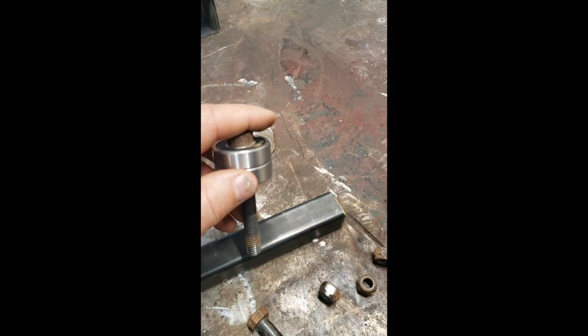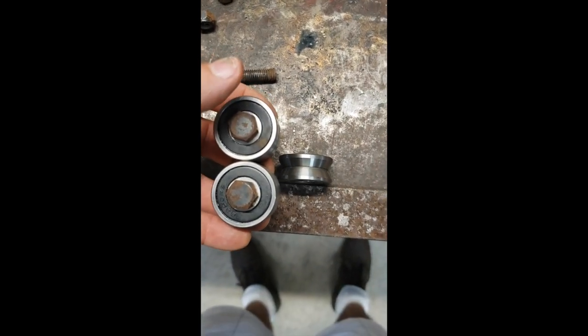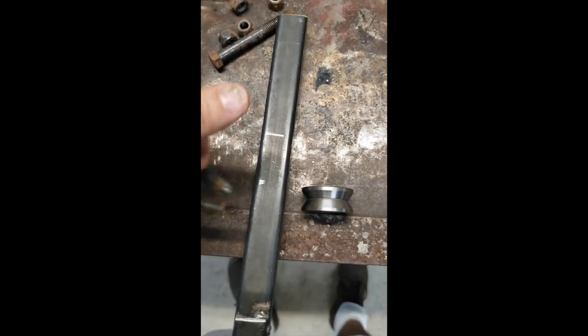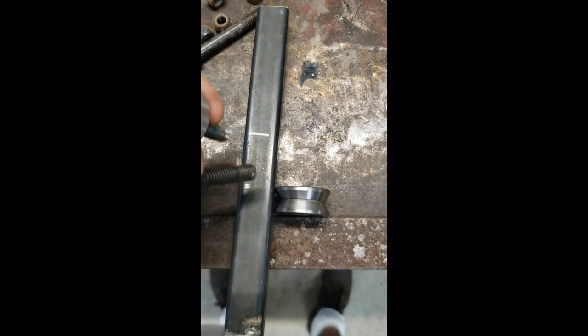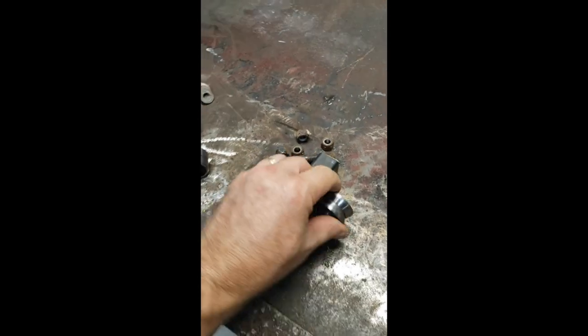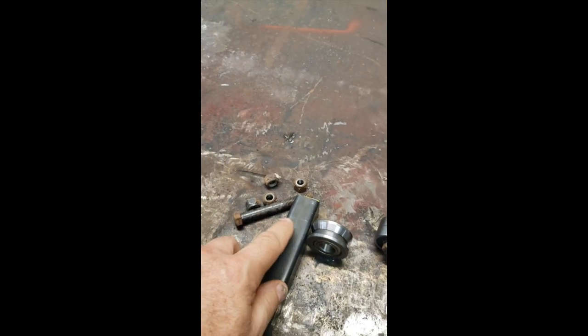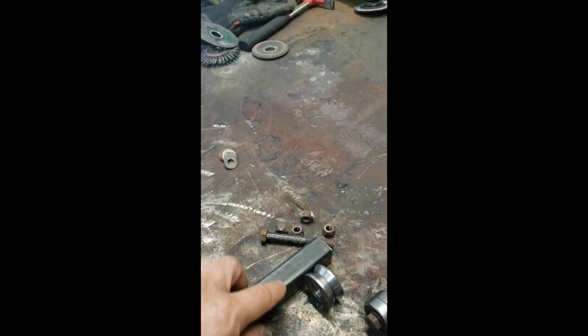The other good thing is that by using this 1-inch tubing here, it's going to allow me to keep the blade, the V-groove, fairly close to it. I've been looking at it, and I think if I put the 1-inch tubing next to it, you'll see I can get pretty close with it, and then these two will sit relatively close. Kind of hard to tell with that, but this gives me the ability to mount these two in here and still keep the back bearing fairly close to this, because you want this to be as close as possible. Not that it's going to be touching it all the time, I don't believe. I guess we'll find out. But anyway, the plan is to use a metal rod on the back side that's going to give me some ability to adjust up and down, left and right, the whole head. So I'm thinking that by using this 1-inch tubing, I should be able to get away with that.